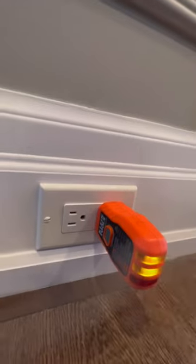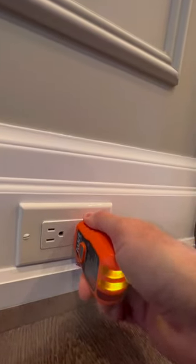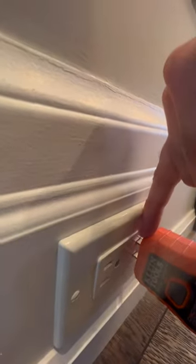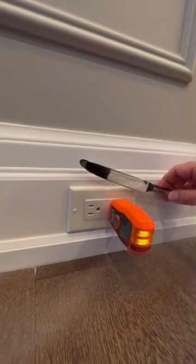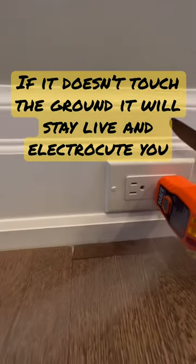So here's the issue. We've got power in this outlet. I can wiggle this out pretty far — you can see there's a lot of space in there, I could probably almost put my finger in there. If you had a child or anything metal that's above that and falls into that area, it is now going to touch your hot terminal and probably the ground is gonna short out and cause an issue.